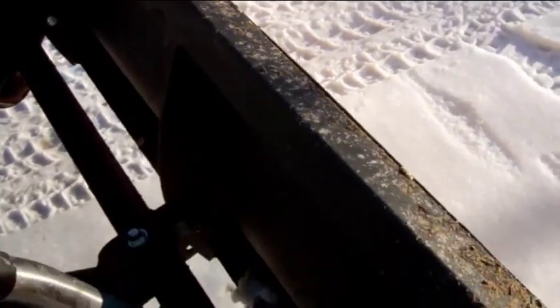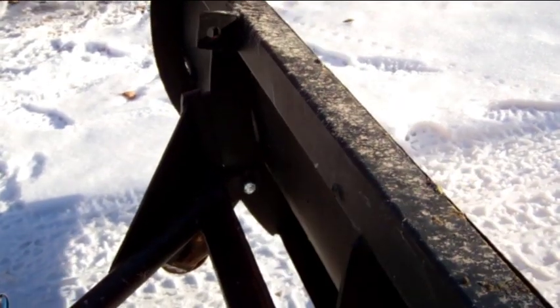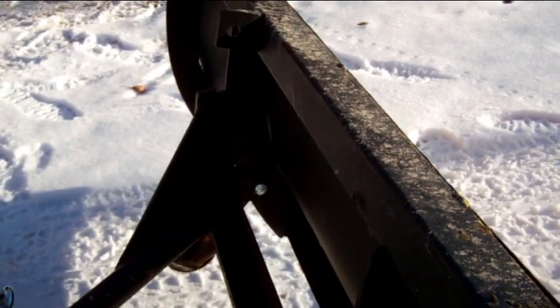To give you an idea of how the blade moves: you can see it's pivoting across three pins. When the spring is in that little top eyelet it pulls it flat against there, and that gives you the tipping action so it doesn't bend.